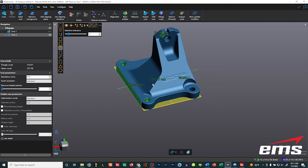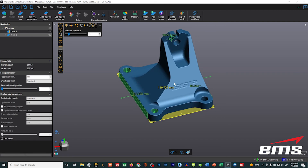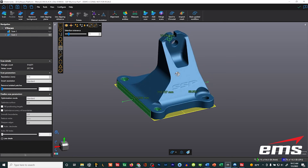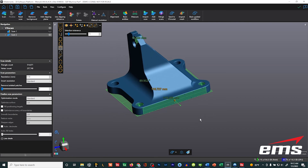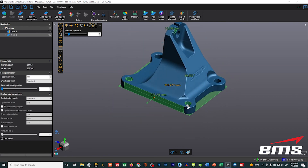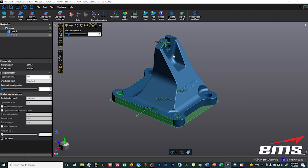So very quickly we can build some basic geometry and pull some measurements. If you're just trying to do a quick inspection of a part and want to measure feature to feature without getting into alignments and GD&T, you can just build some basic geometry and pull measurements without having to go into other software. The measurements are now in their own dropdown with the digital caliper for quick measurements, and measurements to point-to-point on scan data or to constructed geometry.